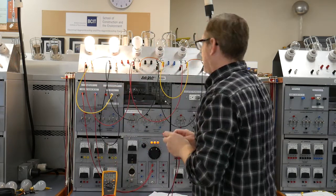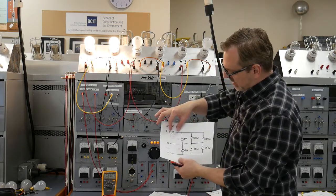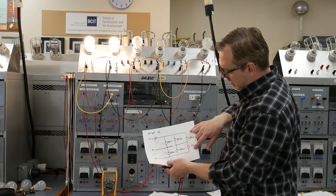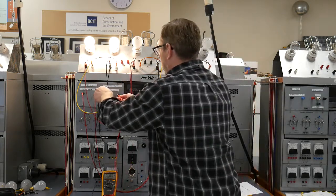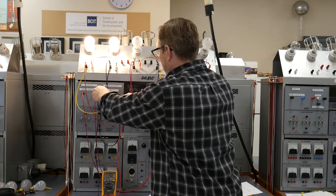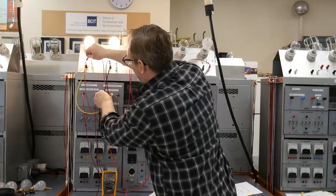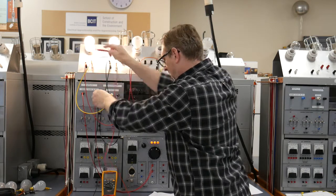Okay, so anytime we've ever done a voltage drop across an open fuse or a broken fuse, we take the 240 source new values and subtract it from the original. So my line to line here is 219. If we subtracted the 10 volts out here, we should get roughly across that open fuse 209, which we do. We've got 208.9, 209.